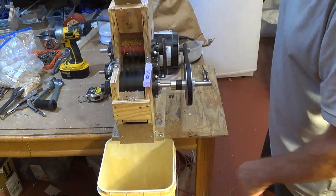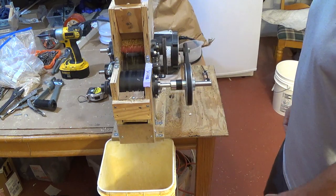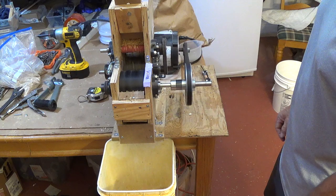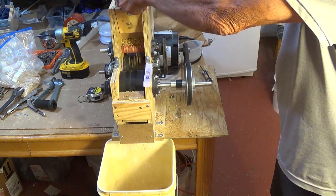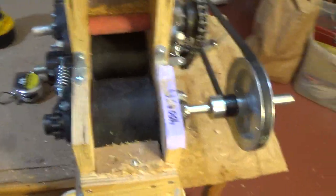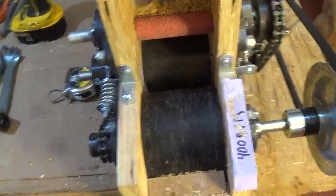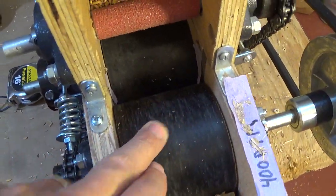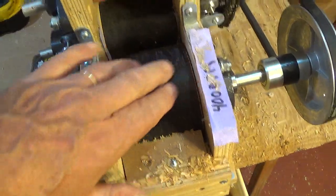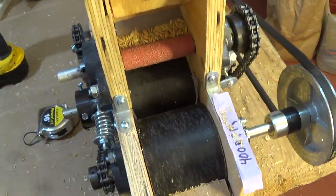So I'm going to check the wear. I looked at it earlier and I'm at 70 or 80 percent. I'll just keep feeding it until I go through 90 percent of the paddy that I have. I'm going to run 10 pounds of rice through it at 50 pounds or so an hour. Here's what I just ran through. Here's what the rollers look like — they do have some markings on them. I don't know if that's real wear; there are no grooves. This was our normal setup. We ran it at 400 RPM.